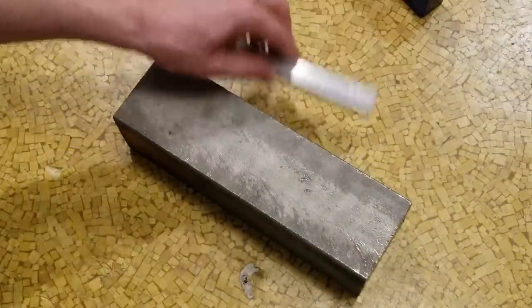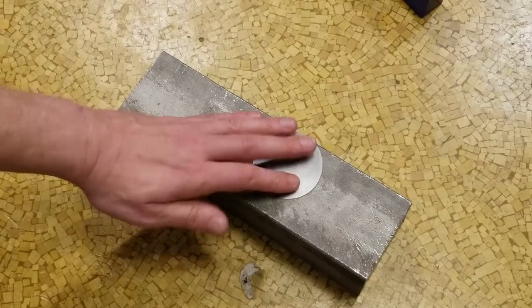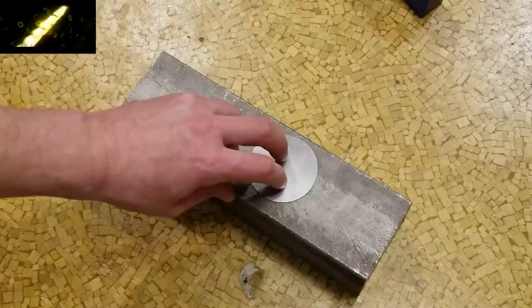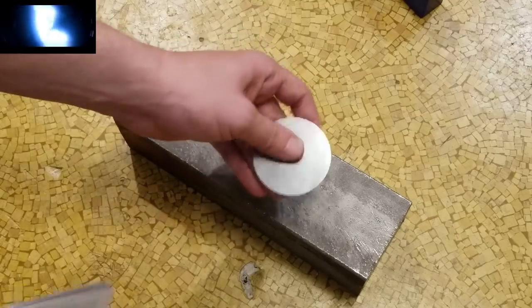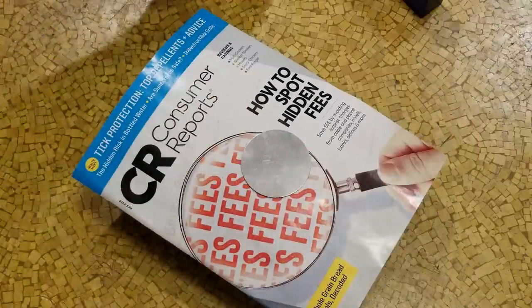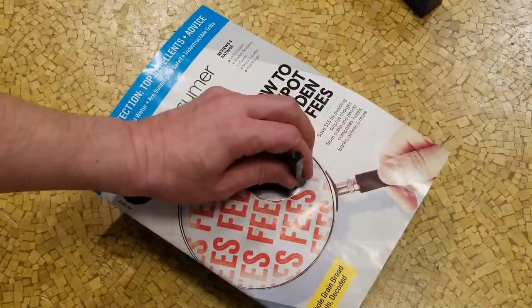On to the tip about sheet metal. With sheet metal, if you just use the stamps, you need something proper and solid — this is a pretty thick piece of steel to provide a good solid backing. If a piece of material is too thin, what you're doing with the stamp is there's not really enough cross-section to upset; you're actually trying to cut it out like a cookie cutter. So you want to put something under it. Wood, unless it's like oak, really is too soft. I recommend something like a magazine — magazines are made out of that clay paper and it tends to work out much better.